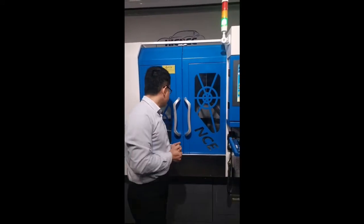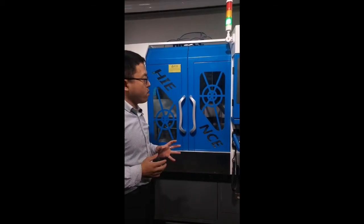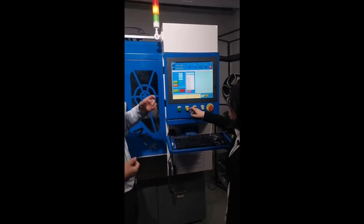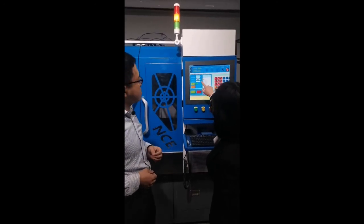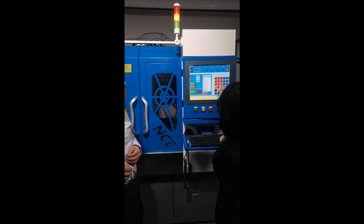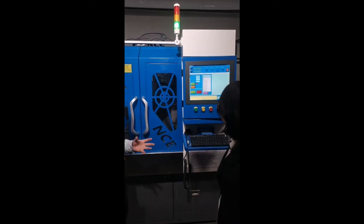Okay, Carrie, I think this time the cutter is cutting the wheel a little, so I want to cut more. I want to stop the machine and cut more. Now I will press this button, this yellow one. Stop. The processing is stopping now. Please input more single cutting. The single cutting depth? Yes. Negative 0.1. Okay, start again. Close. Start process. Enter. The machine starts to repair the wheel again.